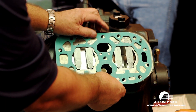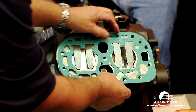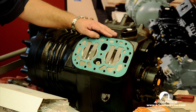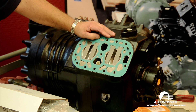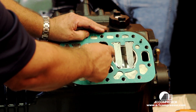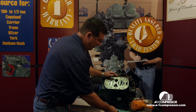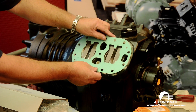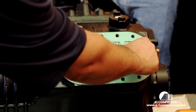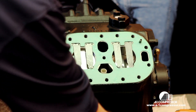If it hangs inside and outside the cylinder wall — as you can see, this hangs outside the cylinder wall — this would be the wrong gasket. To install this gasket would completely kill the efficiency of the compressor because all your high compressed gas, when the piston comes up to top dead center, it's going to fill in these little areas here, strictly killing the efficiency of the compressor. This is not the gasket you want to use. The correct gasket is this one here, which absolutely matches the cylinder walls exactly — good, clean efficiency. That's our head gasket.